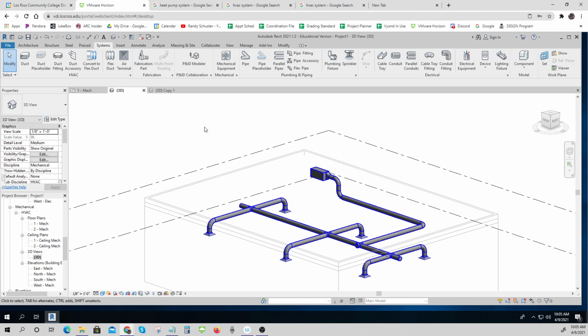So let's see what it looks like up here. Here's the big blower. That's the air handler unit. Somewhere up on here, this one's called a packaged unit, so it's got the compressor and condenser already in it. It's a packaged unit, and it says how big it is. I put in 30,000 BTU. Divide that by 12,000, right? So it's like a 2.5 ton unit. So it might be appropriate to one of the sizes of your areas.